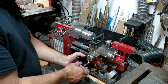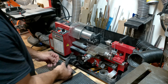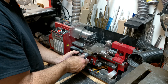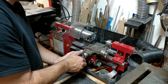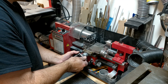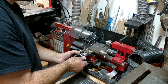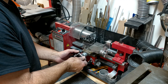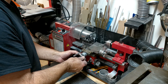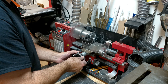As I mentioned, I used a lathe to get some of the parts to fit together. I have a small hobbyist lathe — it won't do very large parts and I'm really pushing it in terms of the diameter of these pieces. It allows me to thin out the parts and lathe out the inner walls, making it very quick to get all these parts to fit together so that one slides over the other. All the three-inch pieces and the one and a half inch piece all have to slide over the 30-inch, two-inch diameter tube, and the lathe made easy work of all of it.